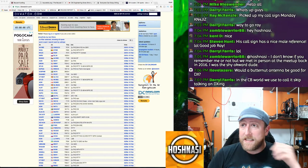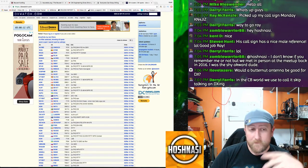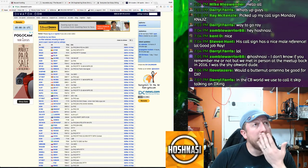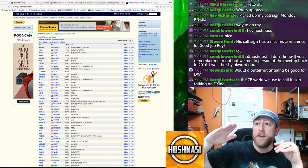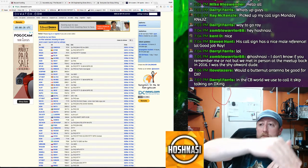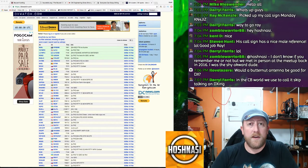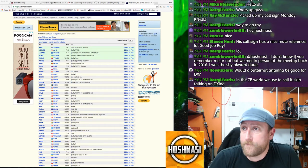Yeah, so Daryl says DXing in the CB world is called skip talking, and there's another name for skip in ham radio, but basically you're skipping off the atmosphere. The RF will travel through some part of the atmosphere, hit one part of it, and then bounce and come back down, and that gives you this really long path around the earth or wherever you're trying to hit.